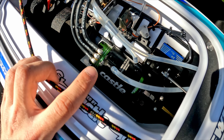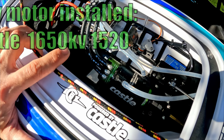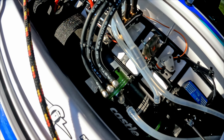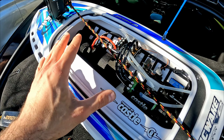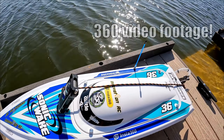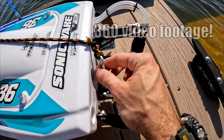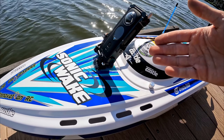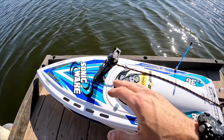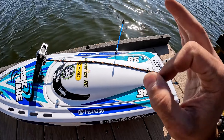Just look how pretty this is. On our 1520-1650KV motor, we have pure 8-gauge wire with silver solder directly to the ESC with 6.5-millimeter bullets. No adapters, no extensions — everything is just direct right here. We also have our little 360 camera running, and this little safety line is actually attached back here so it doesn't disturb anything. If the 360 camera comes detached, we're not going to lose it — it's attached right here and not bothering anything, so everything is A-OK.